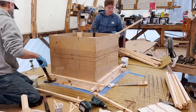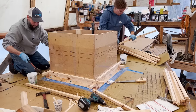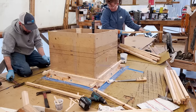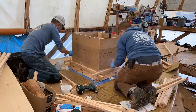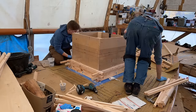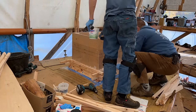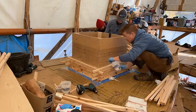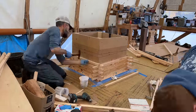And it makes great use of this less than amazing cedar that we have. So instead of having to have beautiful quarter sawn teak, or whatever to be able to do this, we can just basically use cedar offcuts and paint it, and it will be probably stronger, definitely lighter. And if something happens to the hatch, it's not the most repairable thing, but these structures kind of all stand alone, and if something happens to them, they'll just get replaced.